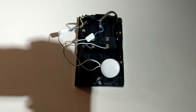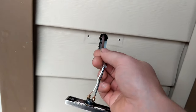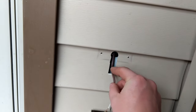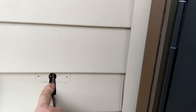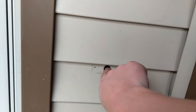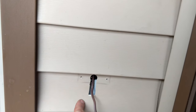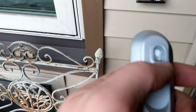Tuck everything in and put the cover back on. Next, take the old doorbell off and expose the two wires behind it. If your doorbell is sideways like this one, you may need to cut down the wood a bit. Depending on how much the siding slides, mount the doorbell plate as close as possible to cover the hole. If you don't want to go into the wood, you can tuck a small piece of wood in there. We're going to mount it to a solid piece of wood. Don't mount your doorbell sideways — the logo needs to be facing up.